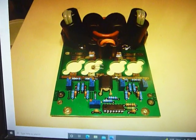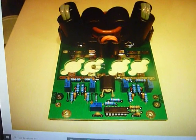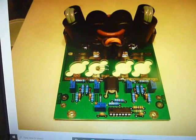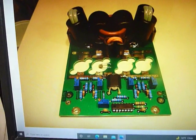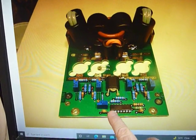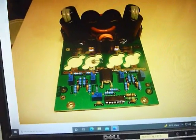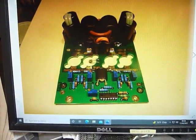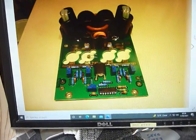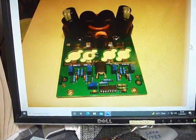This is the circuit board I bought for the amplifier — I'm thinking RM of Italy made it, though I don't recall exactly. I go to these ham fests and pick up stuff. You'll notice there is a 723 regulator chip right there, and that caused some problems — it tends to drift a little bit and the biasing on the amplifier changes. So I put a second regulator, an LM7808, ahead of the 723, and that stabilized things quite a bit.